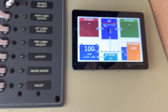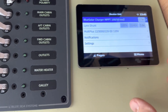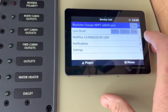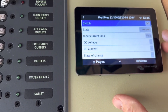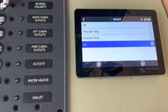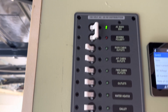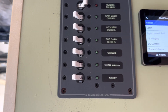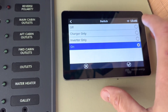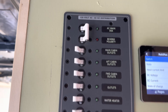You can see the status of the inverter and the AC loads. The cool thing about this is it's got all of our systems connected. If I want to turn the inverter on, you can see the BlueSolar, the shunt, and the MultiPlus. I have it set so that the remotes all work. All I have to do is tap that and turn the inverter on — it clicks on and you'll see the power come up on the AC main, so all our circuits are live. Then we can turn it off just as easily by hitting the switch again, and you see the power is no longer there.